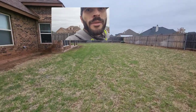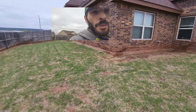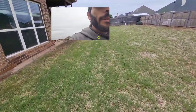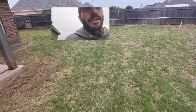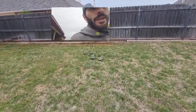I've now gone through every single zone — all 11 — and the area of the yard that hasn't watered is this area here. So now you need to locate your valves. Hopefully you know where your valves are. If you don't, you need to rent a wire locator or call an irrigation company who has one to come out and find them. In this case, I know exactly where all the valves are — they're right here.